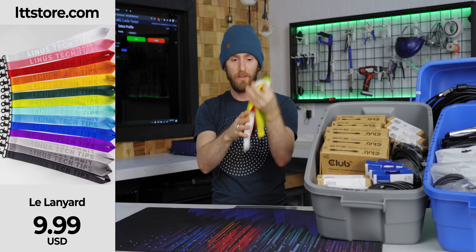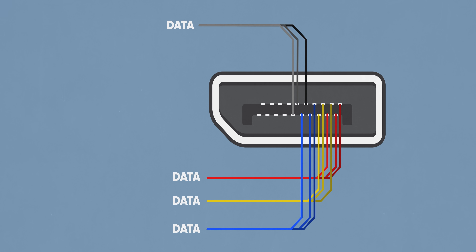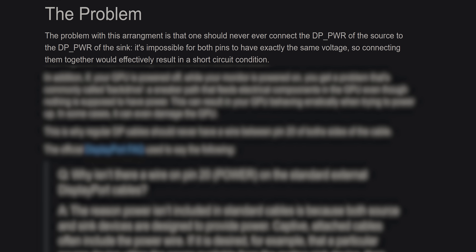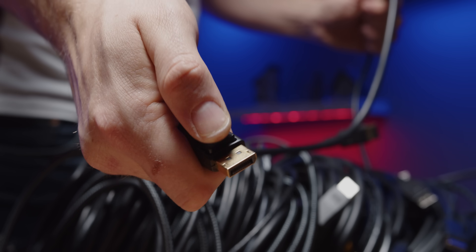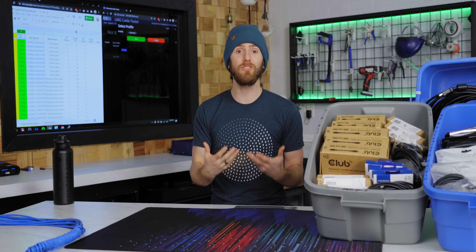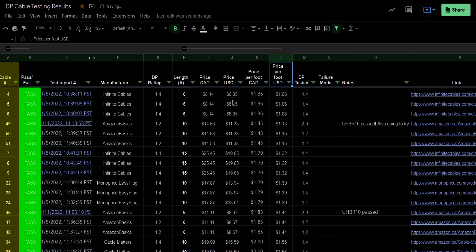This allows each pair to run at a lower frequency while maintaining overall transmission parity with HDMI. With 12 of the 20 conductors used for signal-plus, signal-minus, and ground connections, that leaves eight other conductors used to run a configuration channel, an auxiliary channel, and a power connection. The power connection actually goes unused in common cables and is reserved for devices with integrated DisplayPort cables — having these wires connected can actually cause a short circuit, which was a problem in the past, particularly with cheap Mini DisplayPort cables. Fun fact: those locking tabs on the end are not actually part of the official DisplayPort specification, though they are nice to have.